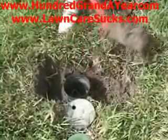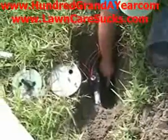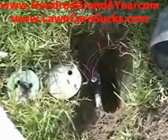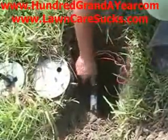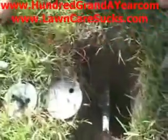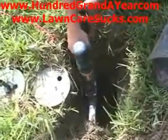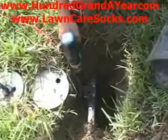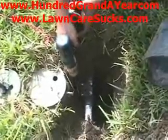Now, when I take this valve apart, it's quite possible that there'll be a lot of water coming out, so I've dug a deeper hole so that when I take it apart, if the water starts flowing out quickly, we need to be able to scoop that water out of there with either a hand pump or a plastic cup or something like that, because we don't want to get any rocks and dirt into the piping.